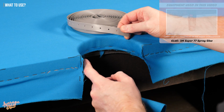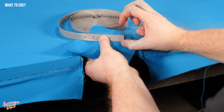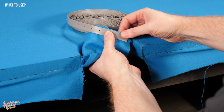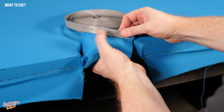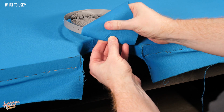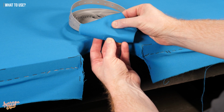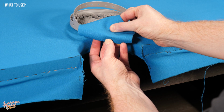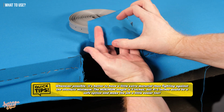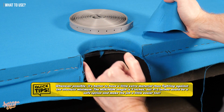With regards to the size of the material, obviously you're going to need whatever width it is that you need, but what about the height? You have to remember our strapping here is 3/4 inch, and the way that's going to work is it needs to come down, so that's 3/4 inch. It needs to go over that, so that's another 3/4 inch, so you're already at 1.5 inches, and then you need enough material to fold underneath the slate and be stapled on. So you ideally want another minimum of 1.5 inches there. So you're going to need a minimum realistically of 3 inches of material plus the width that you need to fill the pocket.